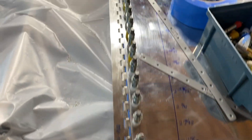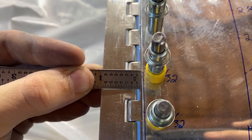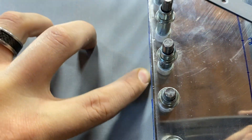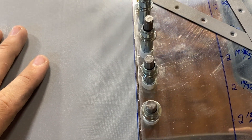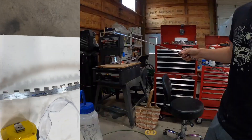Just got this hinge drilled on — let it extend a sixteenth of an inch. So now with the cowling on, if you look down you just see flat metal instead of seeing the teeth of the hinge like you do on a lot of builds. On my RV-14 I didn't know this trick, so on that one you can see them. That's the cool thing about doing this — you learn while you go. Got three more to do.